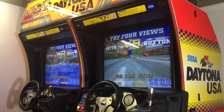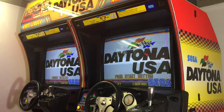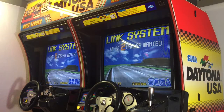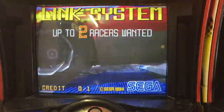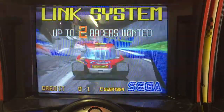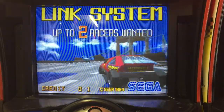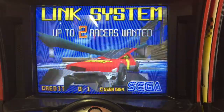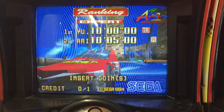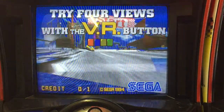The 3D graphical glitches I'm referring to appear to be pretty common. I'm actually owning 4 sets of Daytona USA arcade PCBs and they are all suffering from the issue. The issue comes in several levels of severity. What you see now on the screen is the medium level severity. You can clearly see the vector problems in the graphics — the track and the cars aren't quite projected right. The texturization of the polygons however seems to be okay, and that is also characteristic for this issue.